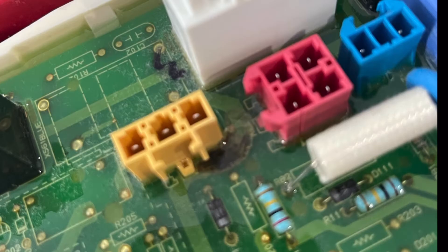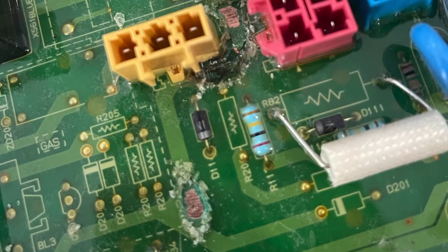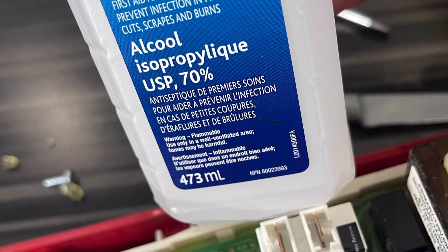There is a burn mark right there on the PCB. I had to find a new route, so I scratched off the silicone and the damaged track until I saw the copper underneath. I then cleaned that area with a screwdriver and a sharp knife, and afterward cleaned it with some rubbing alcohol to make sure there are no remnants left that could cause sparks later on.